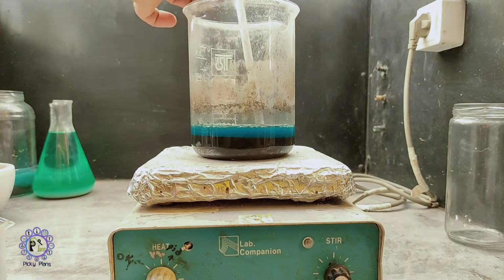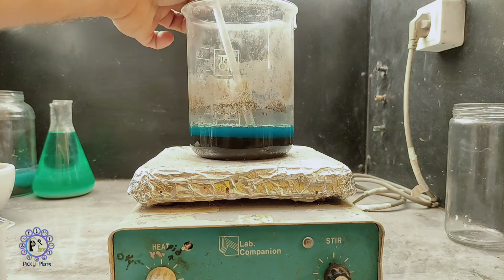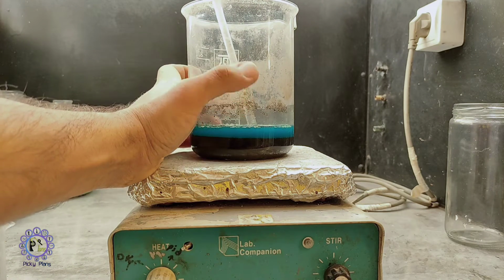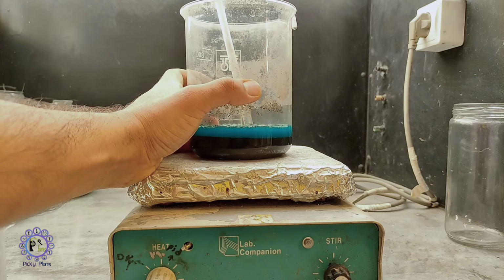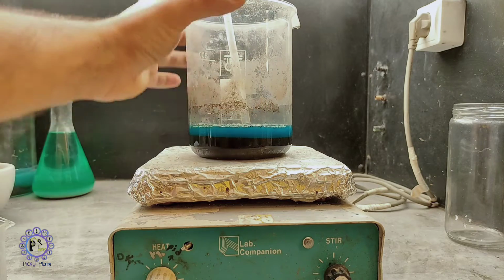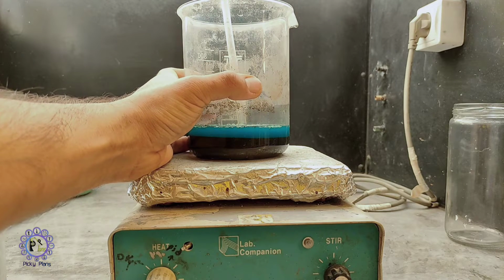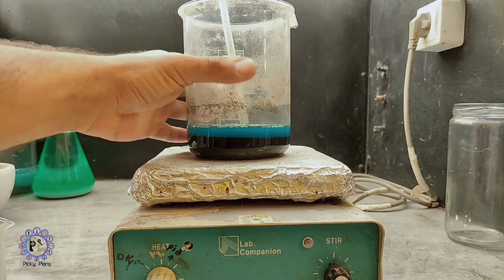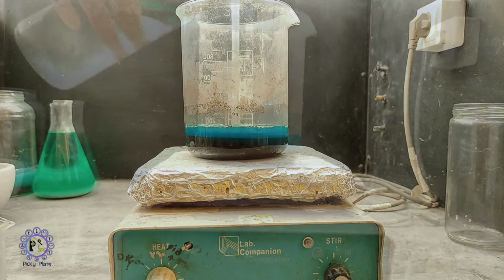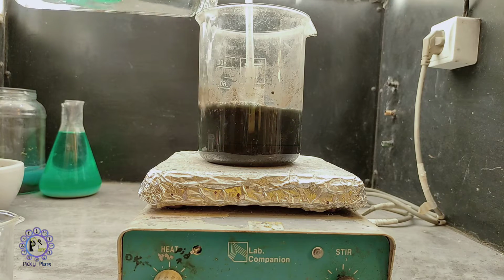The ICs powder is supposed to be left in nitric acid for several hours, but it's been about 2 days that they are left in nitric acid. So there is a possibility that some base metals might precipitate out due to electrochemical reaction. So I decided to give it another rinse with nitric acid to dissolve any possible base metals. However, the first batch of nitric acid seems to be good enough to dissolve 99% of base metals. First I start with washing the used nitric acid, so I add some water to dilute the solution.